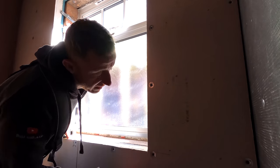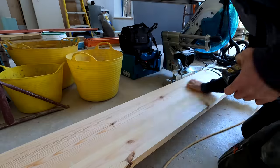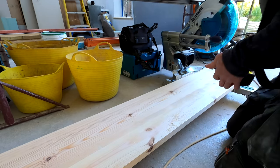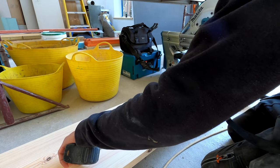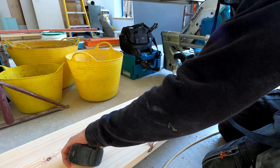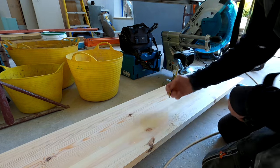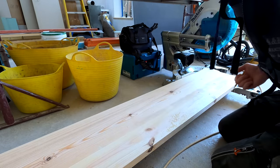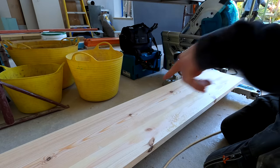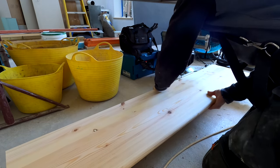I'll also cut round here so the sill board slides in nicely just past into the plasterboard and then it'll be skimmed in nicely and finished off. We need 915 for the inside of the window plus 50mm either side for the nosing, so that is 1015. We need to cut our sill board there and then cut 50mm in either side up to our nosing point, so the sill board is going to sit nice and snug inside. We'll get this chopped off and then we can offer it up and see exactly where we need to put it.